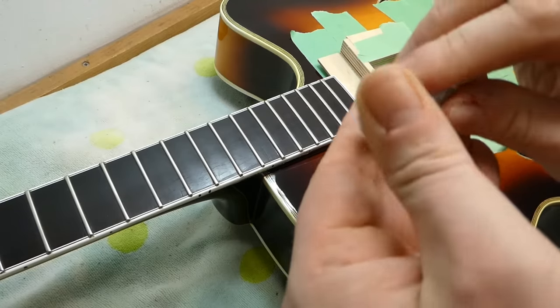Okay, I think we're going to call it. There is one more operation — the bridge pickup is a little bit low, which is not uncommon for dog-ear P90s. Thousands of them left the factory a little bit low. But I could get about a sixteenth of an inch closer to the strings and be happy, so I'll end up making or purchasing a riser for that pickup. Other than that, I like the way it turned out. I'm happy with the pickguard and I like that new adhesive. There's probably going to be someone who complains that I didn't bind this in multi-line purfling, but I think the simplicity is a breath of fresh air — there's enough multi-line purfling all around the guitar. And yeah, it's still actually quite loud and functional as an unamplified archtop.